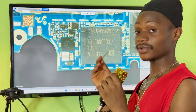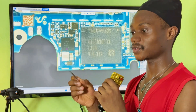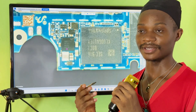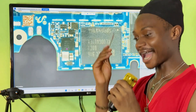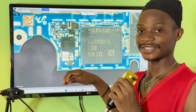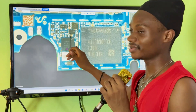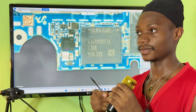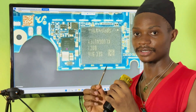When you inject the voltage, you will normally see a high current consumption in your DC power supply. If it's a zero-ohm short, the current will be very high. If the short is not zero ohm, the current won't be as high, but you will still get a component heating up on the PCB. A component heating up doesn't always mean that IC is bad — you still need to check other sections to see if a capacitor anywhere is causing the short and making different ICs heat up.